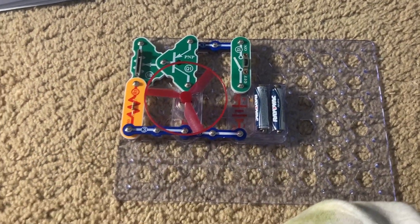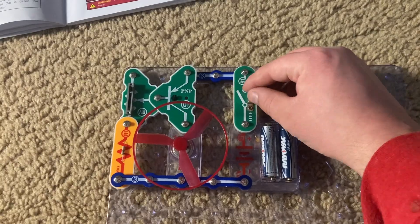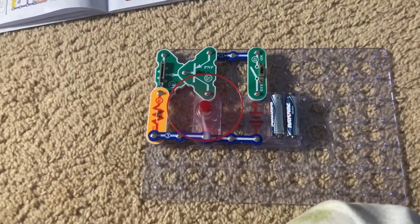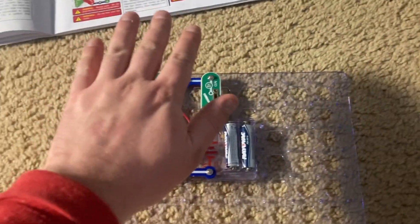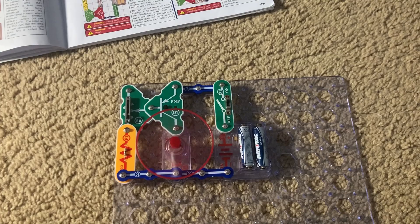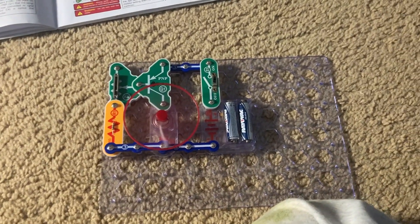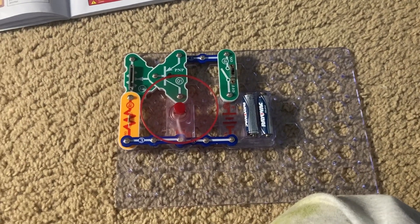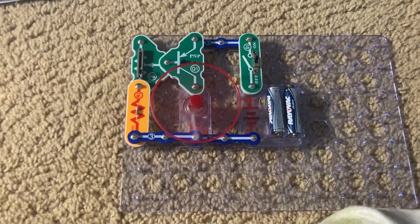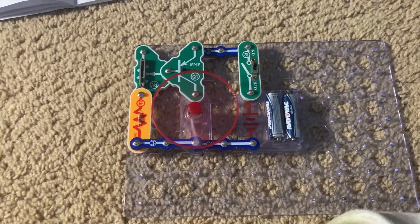For a blowing fan, I turned the motor around so the positive side is facing away from me. I'm going to turn on the slide switch. Again, the range of settings is very narrow. But when the fan is spinning, it's going to blow air up — forcing air from below upward. As a result, the fan will not fly off the motor, even if it was spinning very fast, because the force of the air blowing will hold it down. This is a type of fan you would ideally use to move air for cooling.